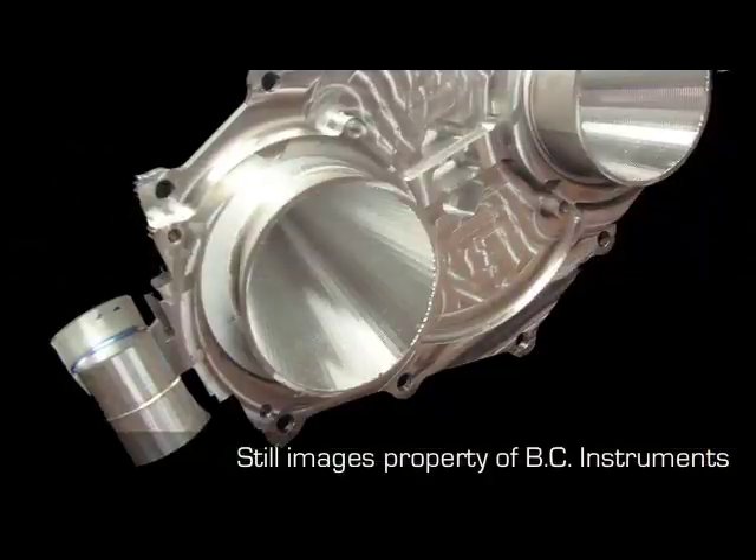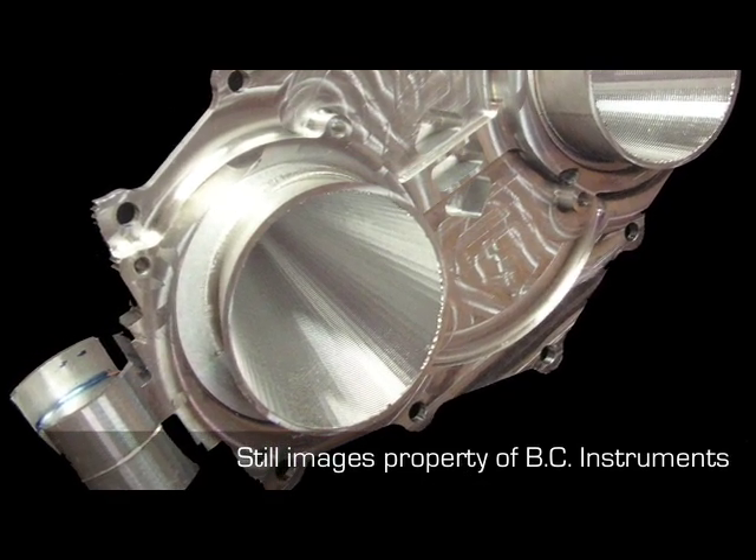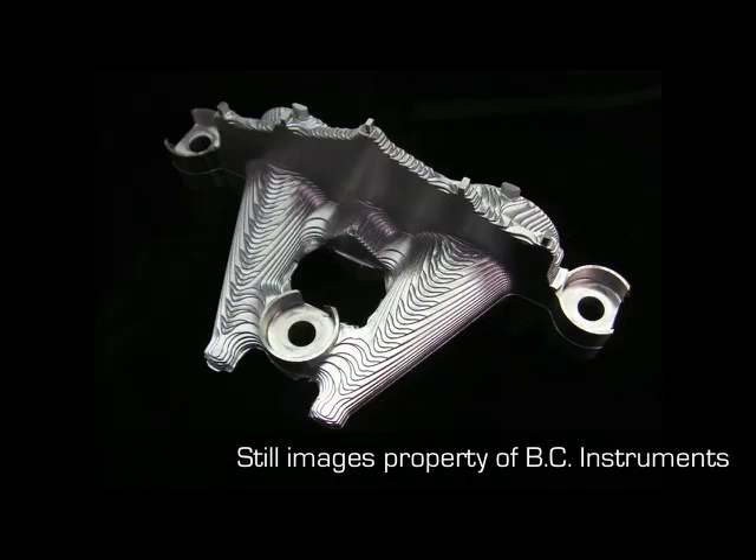When they start working on it, they machine it out of a solid block of titanium. What they do is use a milling machine and actually mill away slight layers until they get the basic shape. Then they use much smaller cuts and much smaller bits to actually machine the exact contour that we need around the funnel and on the inside of the funnel.